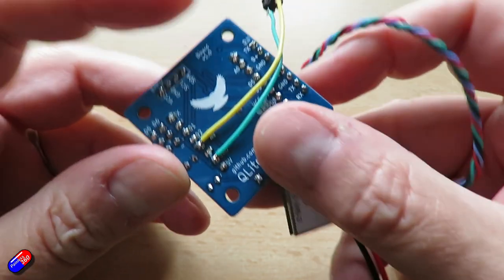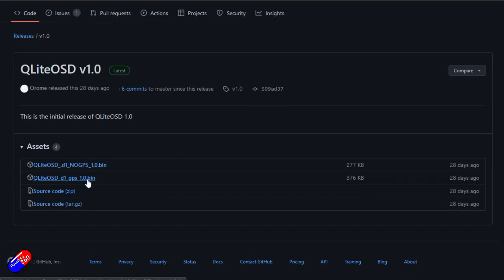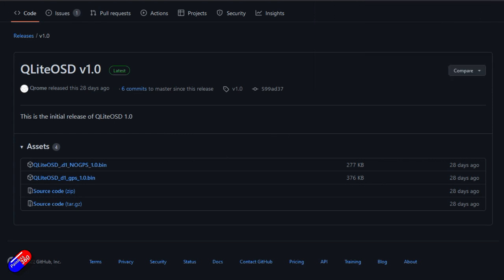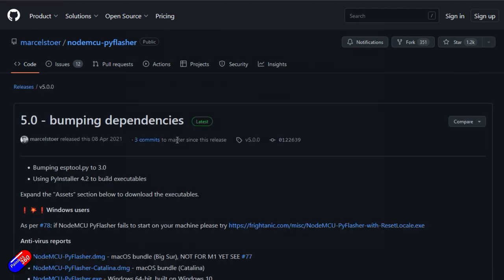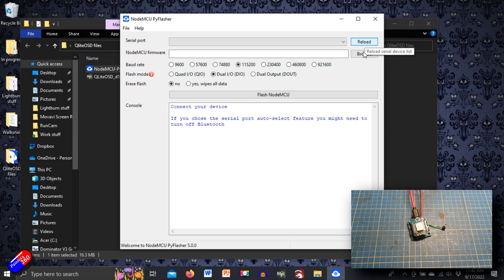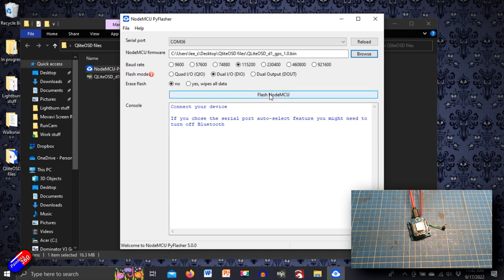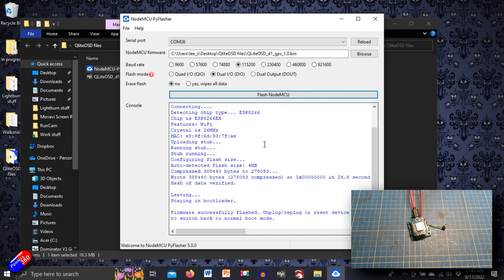Next, load the firmware — links down below for all of this, it's pretty easy. If you haven't already installed the CH340 driver, it needs to be on the PC — install that first, link below. I then downloaded the sketch from GitHub and also downloaded something called Pi Flasher, opened Pi Flasher, plugged in the board, and then selected the bin file. There are two — one with and without a GPS. I'd recommend adding a GPS so you get latitude, longitude and speed. Hit upload and away it goes. Once it's done, unplug it from the computer and it's pretty ready to rock and roll.